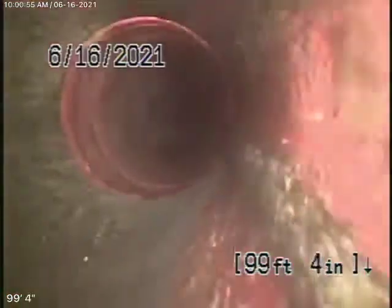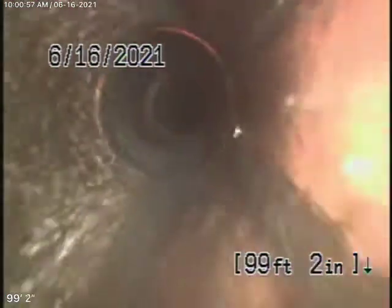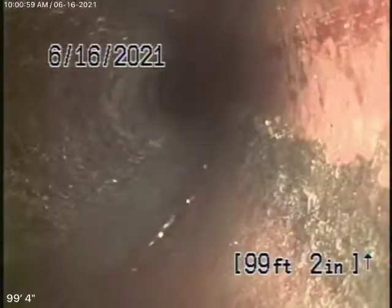Right now we have our camera in from the end-of-line roof vent. We're actually in the city sewer right now — you can see the city sewer flowing by. There's your connection. We have a 6-inch clay pipe coming back from the street towards the property, and it's actually quite a short section before it becomes a 4-inch clay pipe.